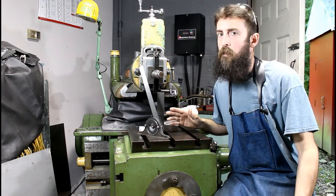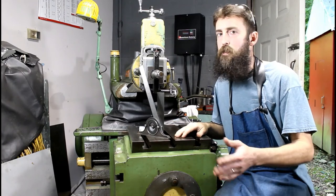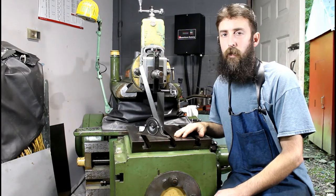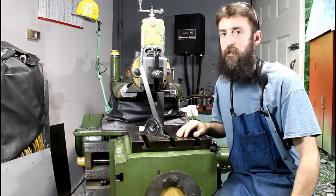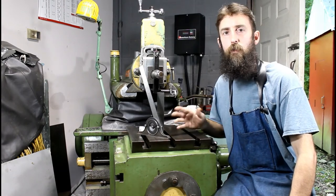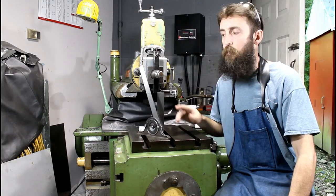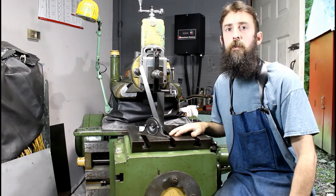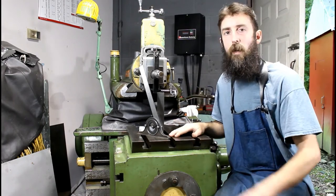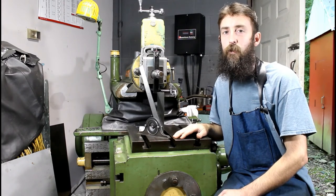But if we're going to put a vice on this machine, that changes things — that adds extra weight to the table, and who knows if the vice is correct anyway. Unless you've checked your vice after you've trammed in your table and compared the two, who knows how true it is. Some of these old shaper vices are not that great — mine wasn't, so I had to do some machining on it, but I got it back within reason. So if you're going to be working out of a vice, tram in the vice. The table doesn't really matter — it's the vice; it's what your work's going to be referencing off of anyway. Working off the table, tram the table in. Work off the vice, tram the vice in. Both fixed jaw, lengthwise, and across. Check it — know your vice. That's pretty important.